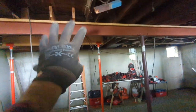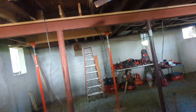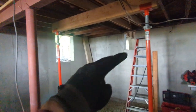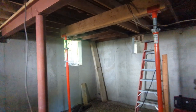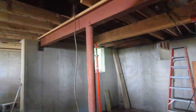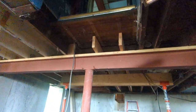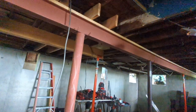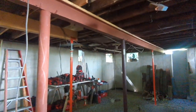But this is where I had to talk to the building inspector before I could really decide where to place these and what size lumber to use, because the next step is nailing it all in, like I was talking about: 4 fasteners every 16 inches. Then I can take this down and move the shores and use them somewhere else and move on. Right now I need them here until I've decided. So no big deal, you just gotta be kind and say, can somebody shoot over here quick and we'll have this conversation? I know what I'm doing. Let's attach those and keep this train moving.